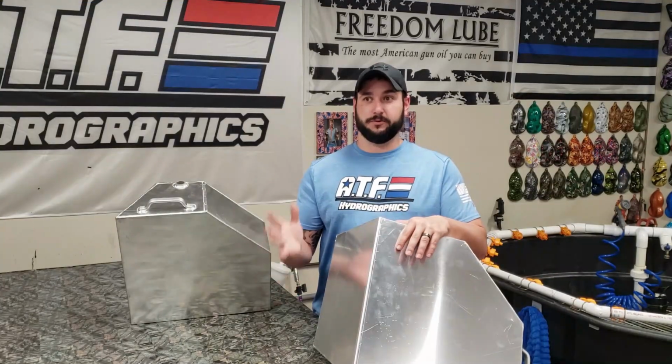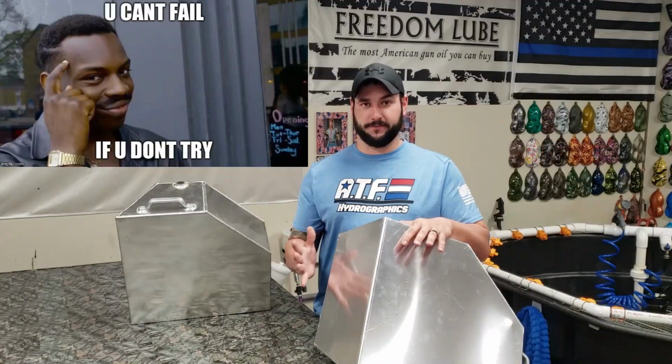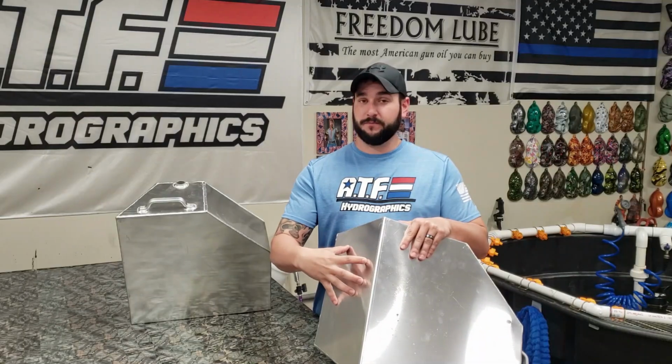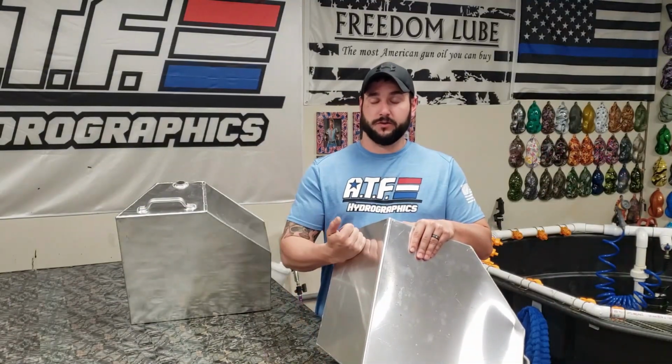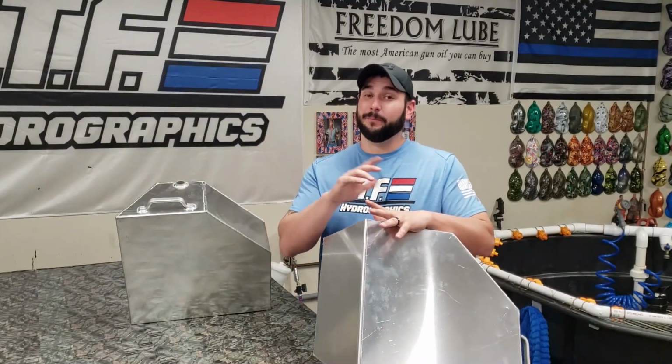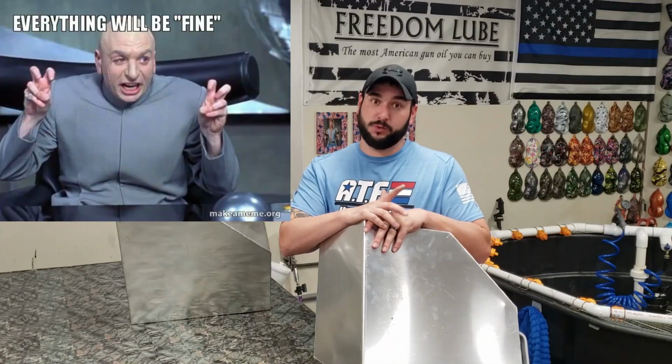So before any of you lose your mind in the comments section, I already know I am not installing this the way that they say to. I get it. We're trying something different. My idea is to scuff the back of this as well as remove the paint and scuff the back of the boat. We're going to install this with 3M 5200, which supposedly never comes off once you put it on. Don't know, but that's what they say. And we're going to use some really big 1/4-inch rivets to install this as well. And considering that the entire boat is assembled with rivets, it should work out just fine.